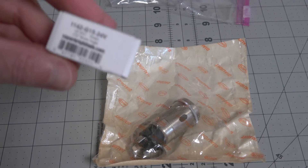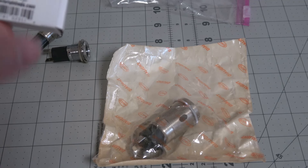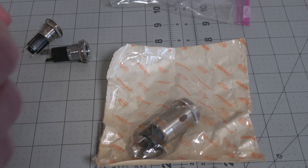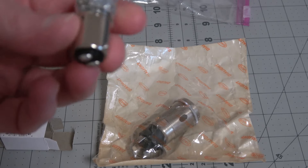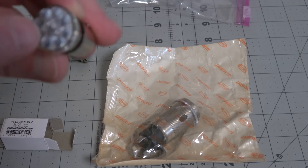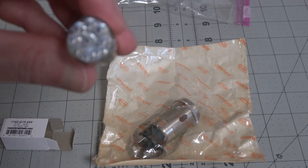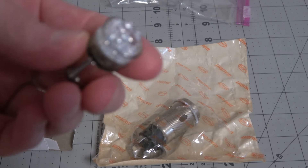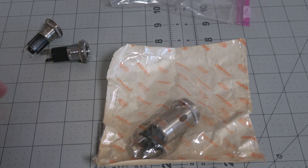What I did is I got these little LEDs — actually colored LEDs. There's a green one and a red one. I got these 1142s in 24 volt. You can get them in 12 volt too, but I like the 24 volts because when you run 12 volts through them, they're a little bit dimmer and they look really good. Instead of the incandescent part at the top, now you have LEDs — like nine little LEDs there. These are super bright when they light up inside the robot, plus they'll save power off the batteries, and you don't have to worry about them burning out either.